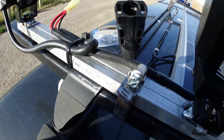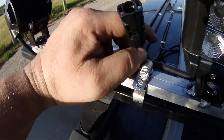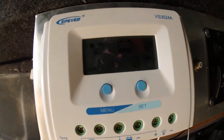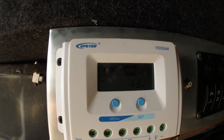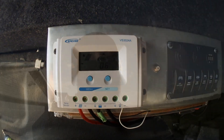After doing some troubleshooting with the multimeter, this pin was the problem. What happened is it pushed down into the sheath. Now that I've got it back up and plugged back in, I should be seeing power. There we go - now we've got some solar happening: 13 volts, 0.6 amps. This time of day, that's not too bad.